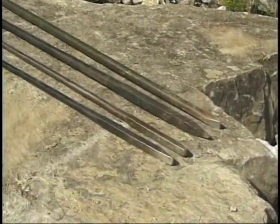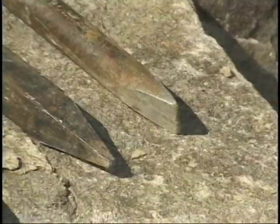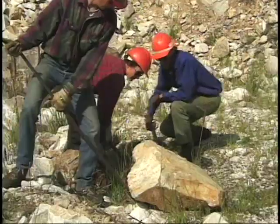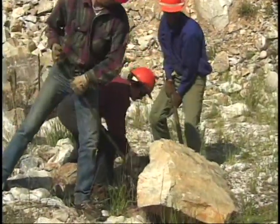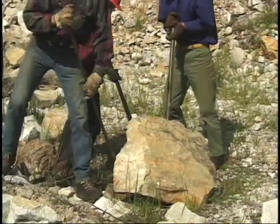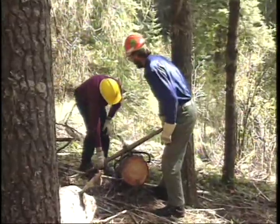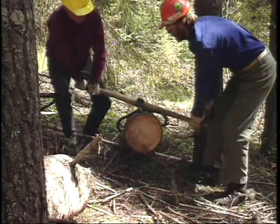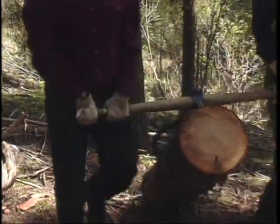The bottom end of a good rock bar is square with a chisel tip — a two inch fulcrum you can use to lift with — and the upper end is usually round. It's best with big rocks to have a team of people. A timber carrier is usually about three and a half feet long with a swinging hook in the center — a two-sided hook that picks up a log. With enough people and fairly big logs, you can carry them safely.